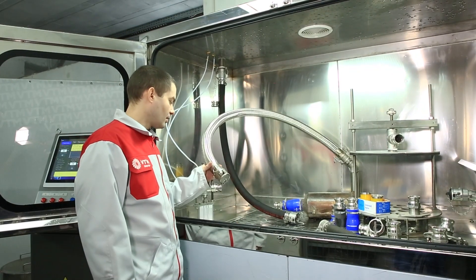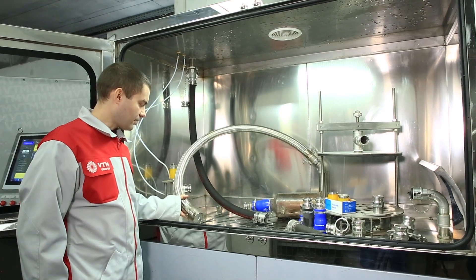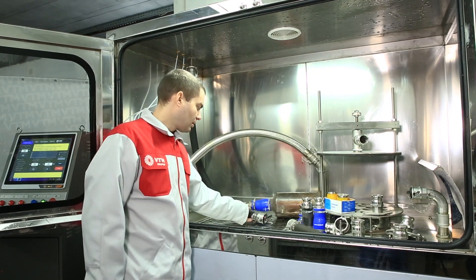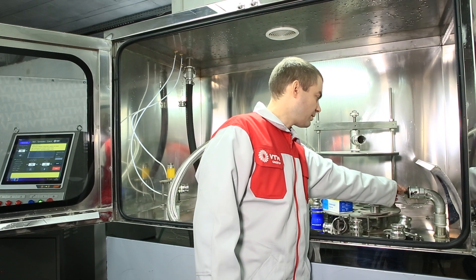In the washing chamber there is a connection to the air system for testing and drying, a connection to the water system for washing the filter, and a connection to the sewer for rewashing the first heavy contamination of the DPF filter.